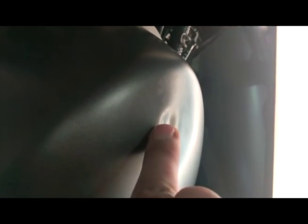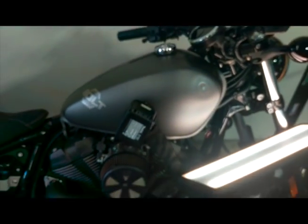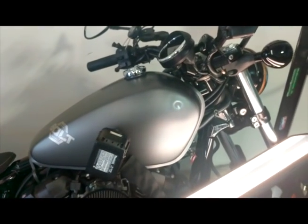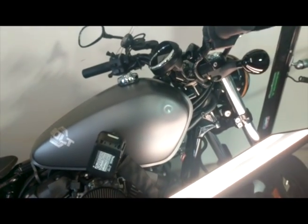Okay, so now I've bridged the gap between here and there, the two crowns. It's pulled it up enough that I'm comfortable knocking down this crown now, knocking down this, and knocking down that, and going from there. Still, the finish is intact. The one thing to remember, guys and girls, is that when you're doing this, take your time. This is a matte finish, and look at how that's puckered up there. So the idea is not to damage that.